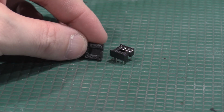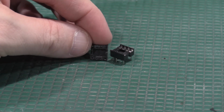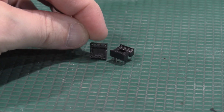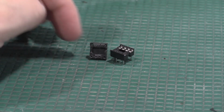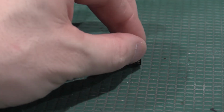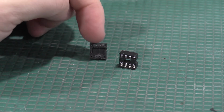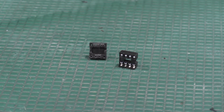What happened was, when these were being made, there was some patent arguments. This is actually a Texas Instrument IC socket. They didn't want to pay royalties. I forget which company to who. So they wanted to make their own socket. And instead of what they did, where with this socket, it grabs the IC pins on the outside of the pins, the flat part, these sockets grabbed the pins on the narrow part of the IC pins.